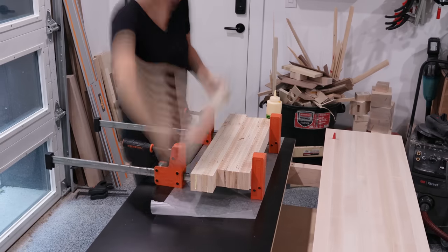My bench actually turned out to be thicker than three inches — it's about three and a quarter. So I couldn't plunge all the way through with the bit that I had. No problem — I just drilled out the rest of the holes with this awesome overdrive bit. This is the bit I used when I made the dog holes on my portable workbench. I liked using the router better, but this is still a great bit. If using a bit like this, you still need to make a template to make sure all the holes are straight and perfectly spaced.